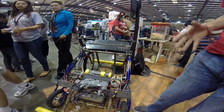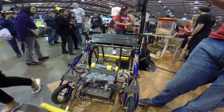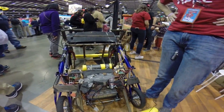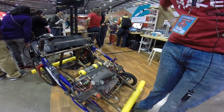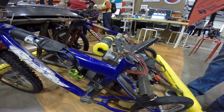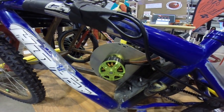What we're doing here is showcasing some of the TI motor control technology. In the race, we're limited to about 1400 watts, and to best make use of that, we want to have a motor that's as efficient as possible. So what we're using are actually three-phase brushless motors from an RC airplane — you can see those green and black things there; those are the actual motors themselves.